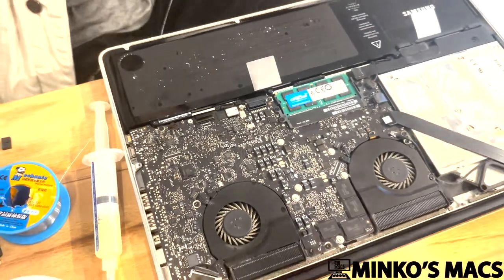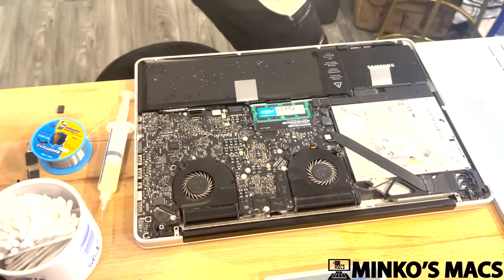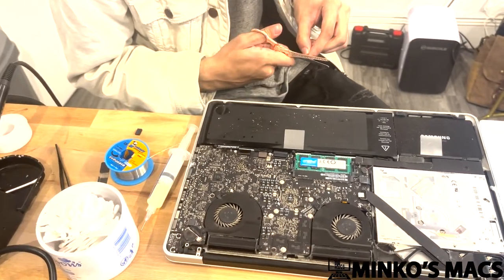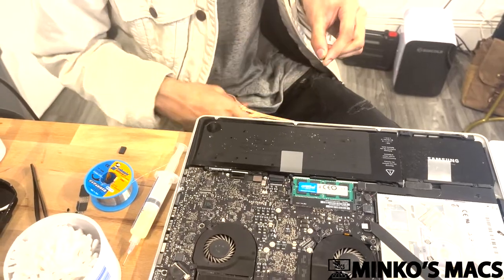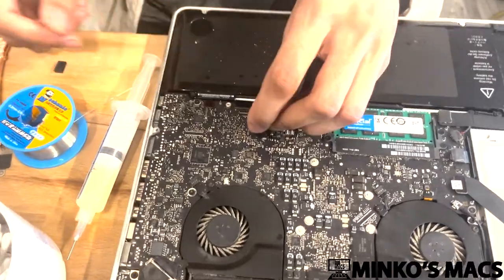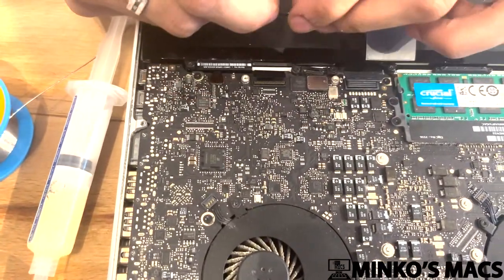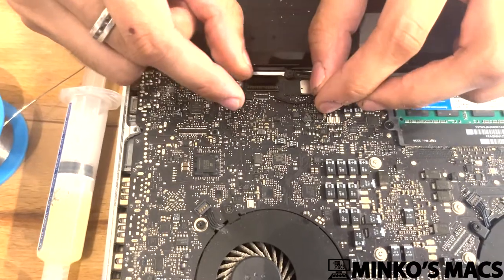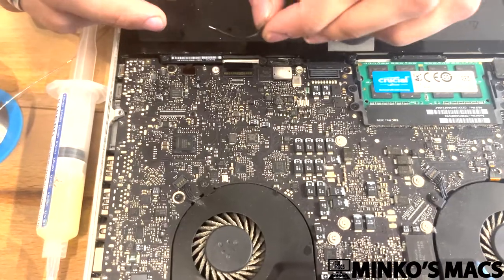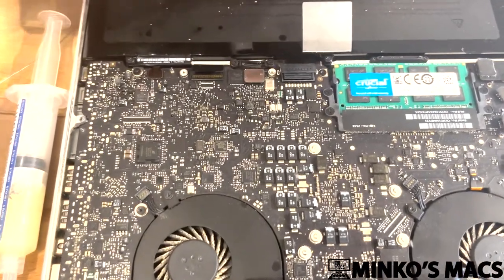This wire is too long. You don't want to use a wire that's too long when you are dealing with the smaller resistor, because it may touch other points and that's the last thing you want. Keep the wire short. This will have to go to ground. To carry this signal over to ground, first pre-bend the wire and choose your determined point. In my case, the point will have to be one of these grounding pads here next to the actual resistor.